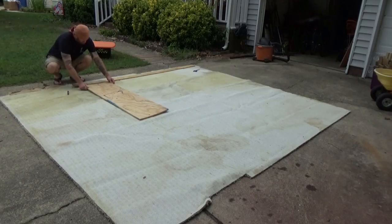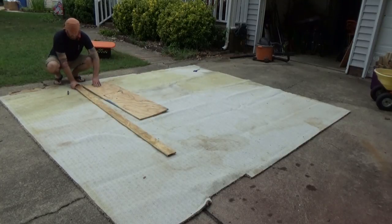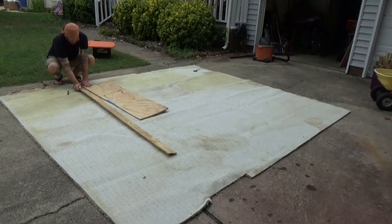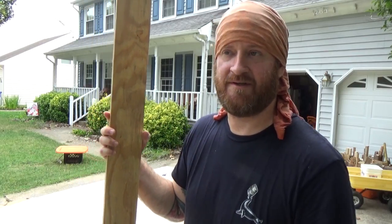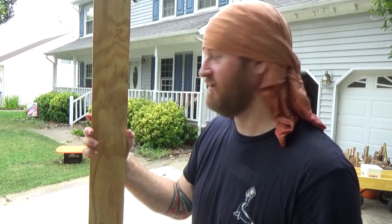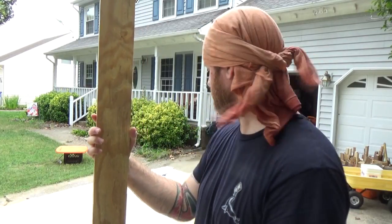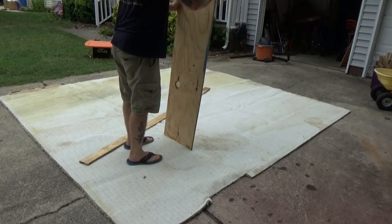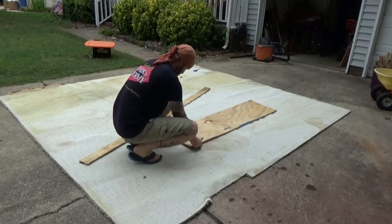But on top of that, I went ahead and I'm cutting about a half an inch to an inch over on each side. I'm squaring it off with another previously cut piece of plywood, which just gives me that exact 90 degree angle. So instead of using a T-square that's only 7 or 8 inches long, which is not going to be terribly accurate on a long area like this, I'm taking that, it's probably 15 inches deep by the full width, so 48 inches deep. So that'll give me a nice straight edge to go by.